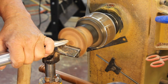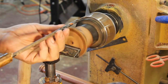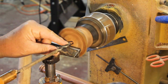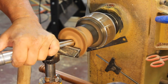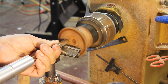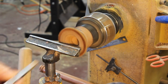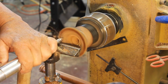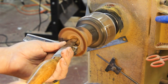I can't reach a lot of this, but I'll get some of the mass out and that'll be easier to take off when I reverse chuck the piece. You're now looking at the inside of the lid, and you'll soon notice that I'm struggling a bit to take out any material because there really isn't any grain to this. So I resort to drilling a hole to the depth of my lid — I'm just marking that with my finger. I'll take a spindle gouge and try to do a little back hollowing, which proves difficult. The best way to take off material is to simply scrape it — cutting from the outside in doesn't work all that well. Here I am starting to develop the female recess for the base tenon, and later on I'll jam chuck this together and finish off the lid. I continue to remove material with my spindle gouge in scraping mode, then resort to a regular scraper to finish off the inside of my lid.